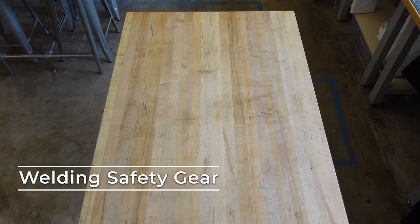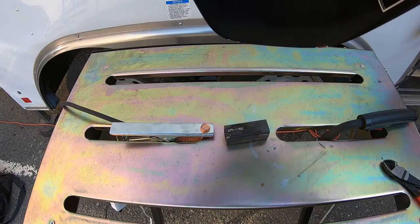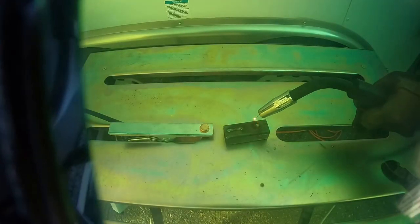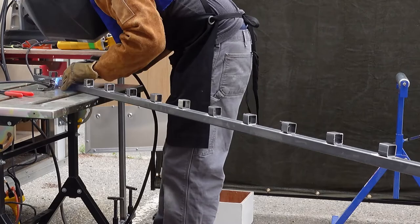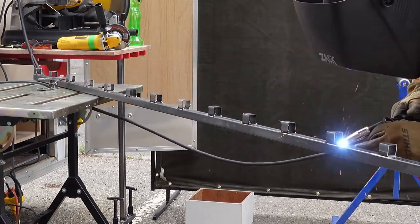Building 61 will provide some really cool gear, including an apron, welding jacket, gloves, and the coolest thing about welding: the auto-dark helmet. Auto-dark helmets use sensors to instantaneously turn a more or less clear lens into a shaded lens dark enough to protect your eyes from the intense ultraviolet light emitted by a welding arc, but allowing you to see your weld. Your eyes are the most vulnerable part of your body around welding. If you are welding or in the vicinity of someone else welding, never look directly at the arc. Any part of your body exposed to the light created while MIG welding can be burned, similar to a bad sunburn. So even if it's really warm, you gotta stay covered up.